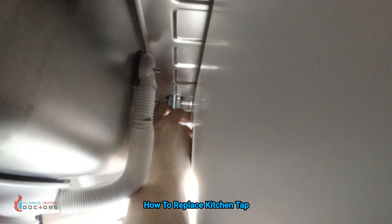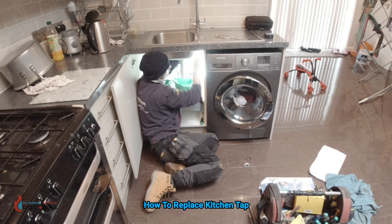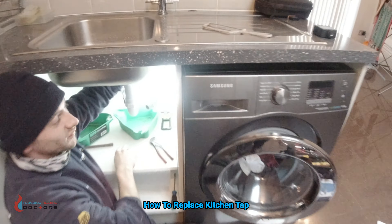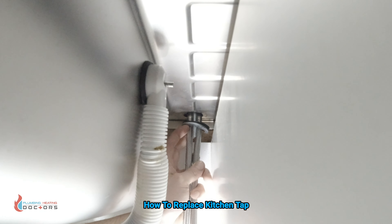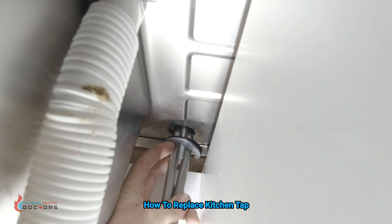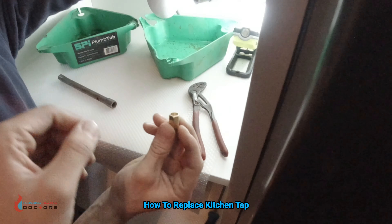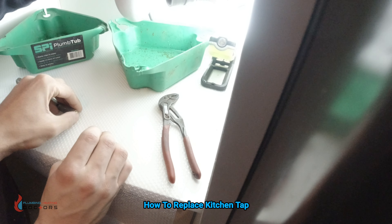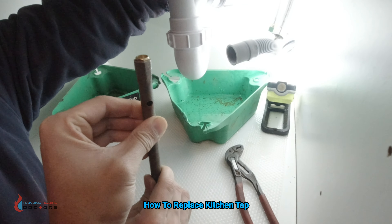Have a look how it's working — this is a plumber's life right here, no crack on show because it's not cheap. As you can see he's got it on there — he's managed to push it up there. What he's going to do now is get the nut on underneath to secure it. The easiest way instead of fiddling around: he's going to get the nut and put it inside the tap spanner, use that to take it up and then screw it on.